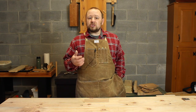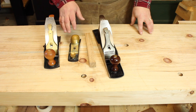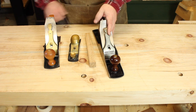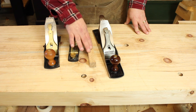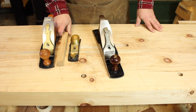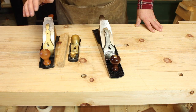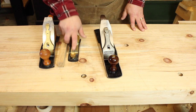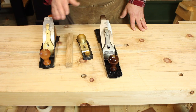In terms of plane choices, you have plenty — there's really no right or wrong answer. A block plane would certainly work, as would a number 4 size smoother or smaller smoother. Even a jack plane would probably work for a piece about this size. My general rule of thumb is that I try not to use a plane that's too much longer than the length of the piece I'm planing. I would probably opt for the smooth plane, as I prefer bench planes over block planes — I feel like I have more control with them. But I wouldn't hesitate to use a number 5 or jack plane. It really comes down to what's going to be more comfortable for you — try them all and see what you feel like you have more control with.